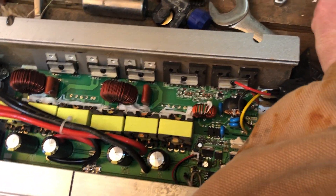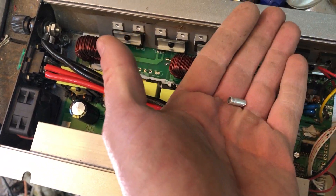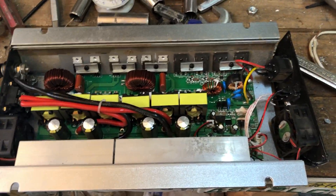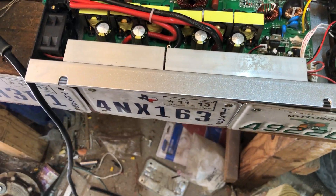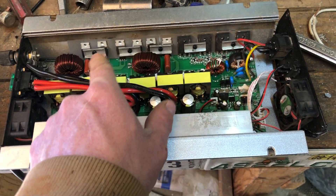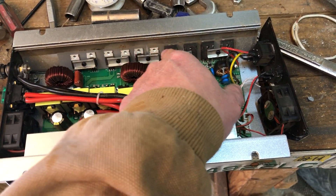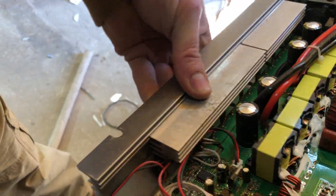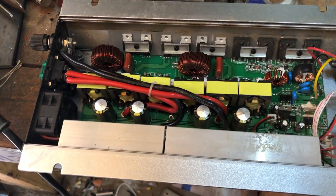there should be one here, and here — and that's what's left of capacitor number three. About every three months I blow one of these things up, at least, sometimes more frequently, and sometimes I blow more than one of them up at once. Generally what happens is either that capacitor blows up — it's always that one capacitor — or there's a whole row of those MOSFETs. I don't really know, but they all blow up. There's one row on that side and one row on the other side, and it will blow every single one of them — they'll all just be full of black shrapnel.